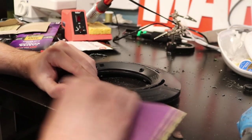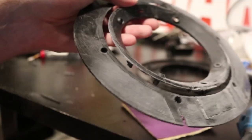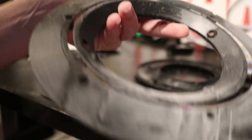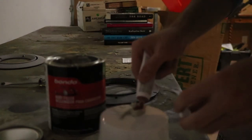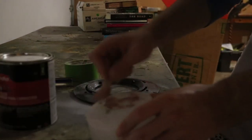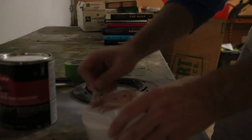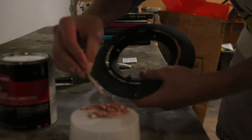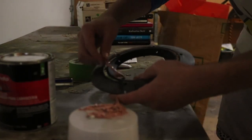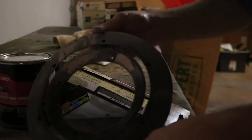So that whole thing about me using the tactile button — that's a lie. I'll talk about it later. Start by using about 400-grit sandpaper, sand away all of that lettering and try to get that battery area down smooth. I then mixed up some Bondo. If you don't know how to mix up Bondo — it's really, really easy. You just mix up the hardener at a pretty easy ratio. I put some masking tape behind that switch hole, dumped some Bondo on there, put some over the box, and sanded it smooth.